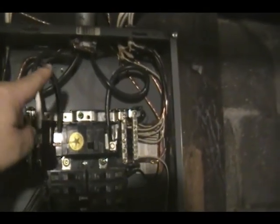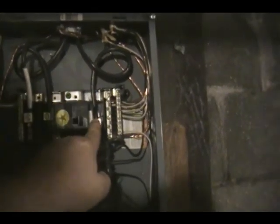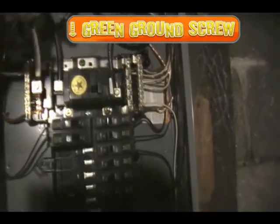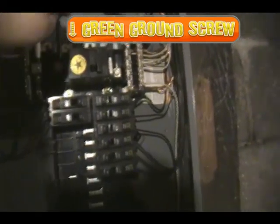We are back at the power box. You've got your power coming in, and up here you have this wire that curls around and comes to here — that is 110 volts. Another line coming around comes to there — that's another 110 volts. The line coming over here with the white tape on it is your neutral line. Your grounds and neutrals are tied together by a screw right here because the bars go across and there's a screw through there which connects both of those.